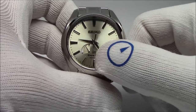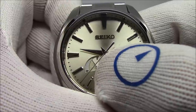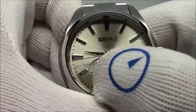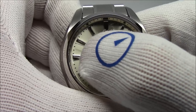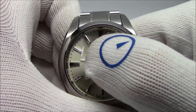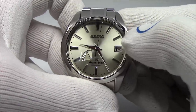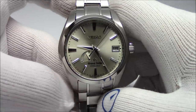Some of the benefits: since it's a feedback loop, there's isochronism. When your watch gets down to low power, watches tend to run erratic — they like to run at full power. This watch doesn't care. It can be two minutes away from dead and it'll still be accurate, because the electromagnetic brake is constantly referencing the quartz crystal to see how much brake it should apply. It's ingenious. It's a breakthrough, and as an engineer I can fully appreciate the technology.